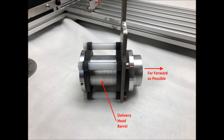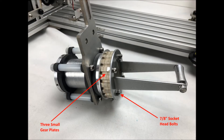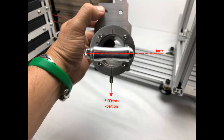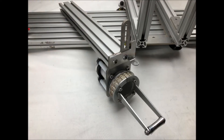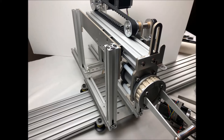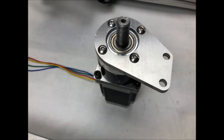Make sure that the barrel is as far forward as possible so that the new plate gear has more room to fit. There are set screws on the large barrel shaft collars that need to be adjusted to move the barrel forward. Next, install the three small gear plates on the barrel and insert the new 7/8-inch socket head bolts and reassemble as shown. Make sure that the limit switch trigger is in the 6 o'clock position when the concave roller is in the horizontal position. Now install the new longer slide bar and insert the slide bar into the pathway created by the black acetal slides that are affixed to the upper two plates. The slide bar should be loose for now and we'll tighten it up a little bit later.